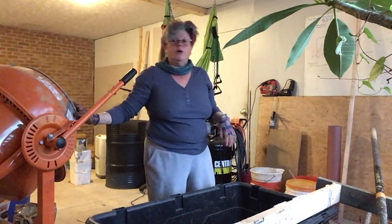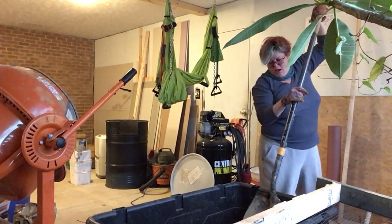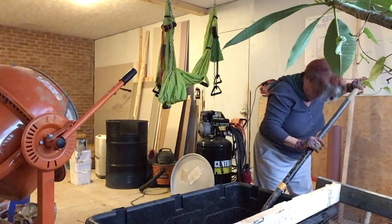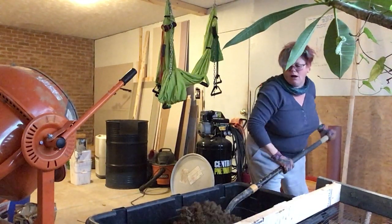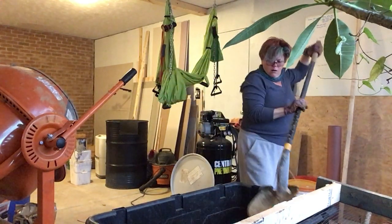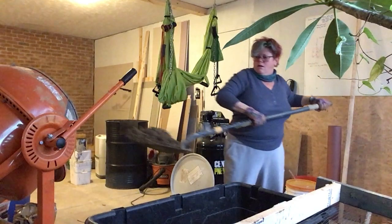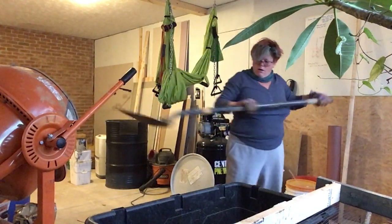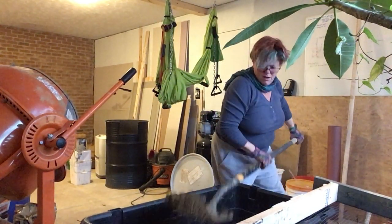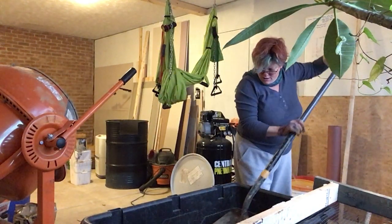That's the idea with the coil. Put it somewhere where the gases can flow down through it or around it, and ideally somewhere where the heat of the stove matches your goals. Now, I've had people who wanted a hot tub, and they put that coil right over the riser and had a pump on it, and it works great for them. You can get a lot of water quickly, but you need to manage it. So there is kind of a coil.